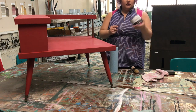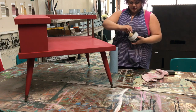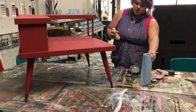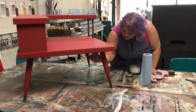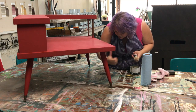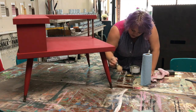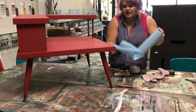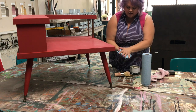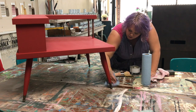We take our Annie Sloan Clear Wax and my Annie Sloan Wax Brush, and you just get a little bit on there. When you are waxing you want to do small sections — let's say a leg here first. You will be able to see where your wax lays down. You might get little bristles in there; it's okay, just take them out. I get my lint-free blue shop towel folded in a square like this, so you can use all the different surfaces and flip it around.